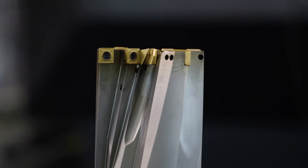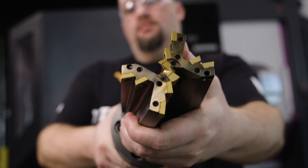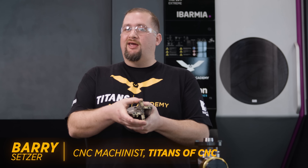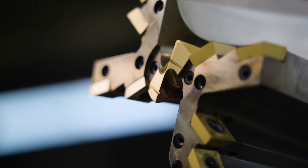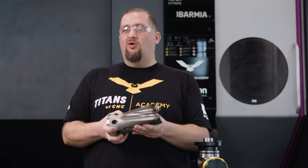Check this thing out. This is the FBX drill from Kennametal, but I like to call it the freaking brutal executioner. Where a normal drill only has two flutes and maybe two cutting edges, this thing takes eight inserts plus a center insert and has four flutes. So you're going to be drilling it at twice the feed you normally would.